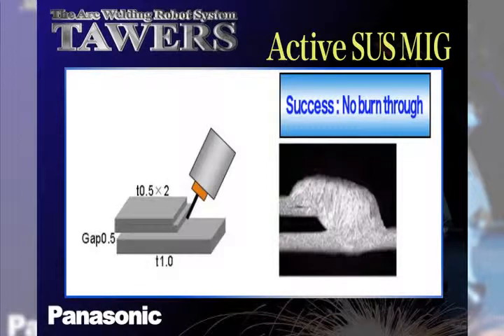Typically, a wide bead may not provide adequate penetration, but with the active wire feed process, the detection of the wire neck is possible, which allows the maximum heat input to be introduced into the weld for the specific condition, generating the wide bead while at the same time getting the penetration required while controlling the weld spatter.